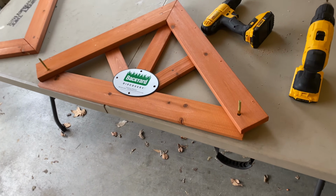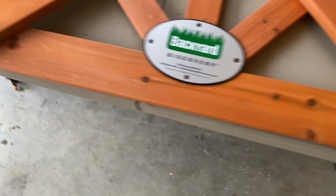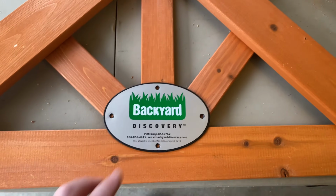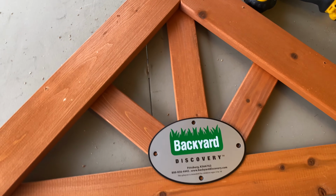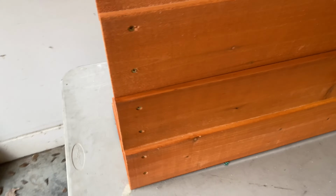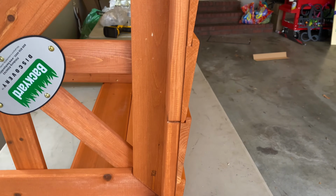So when you get to this part, I just ensured by taking the T40 Allen wrenches they send, those bolt holes are lined up. I'm about to put the 4 screws in here, and of course the other screws are up at the top. Since it is a true tongue and groove, make sure that everything fits snugly in. You can use a rubber hammer if you need to beat it in. I'm about to get a rubber hammer, see if it'll go in any more.